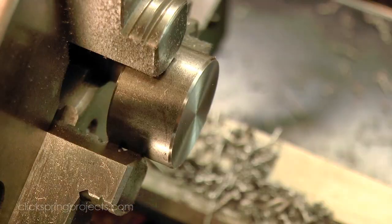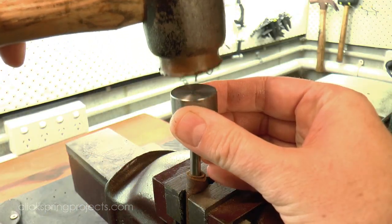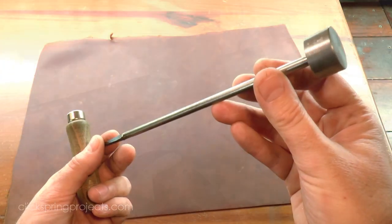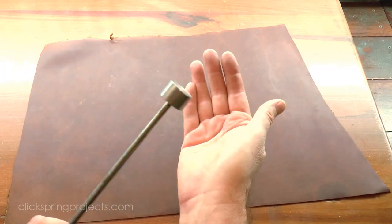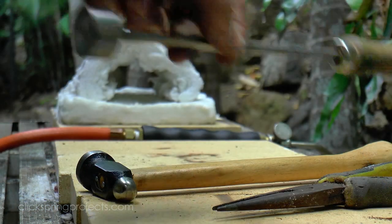For the short tube or band that I'll use to construct A1, I think a plausible suggestion is that a simple former was used, around which the sheet stock was wrapped and then lightly hammered into shape whilst heated. The tool is easily made, and I think it's conceivable that a set was made to generate a range of inside diameters. I'll develop this idea a bit further when making the concentric pointer tubes later in the build.